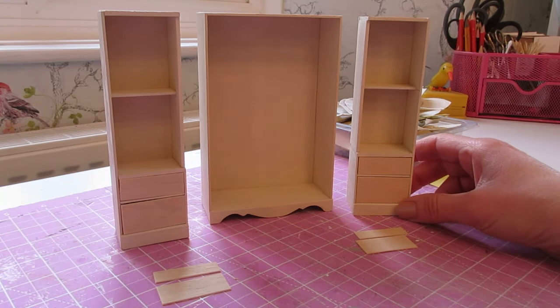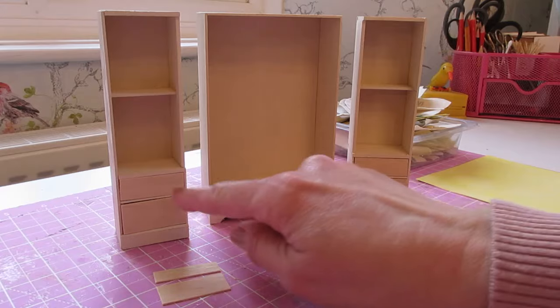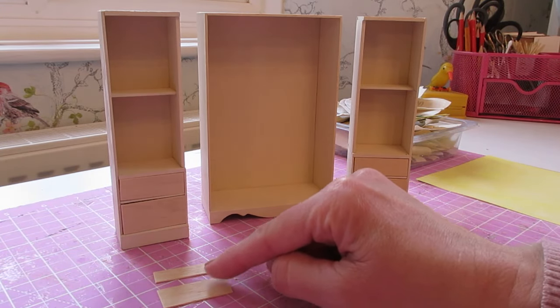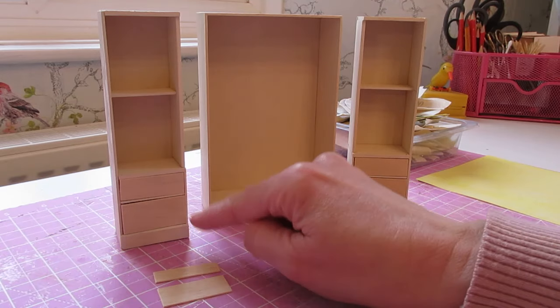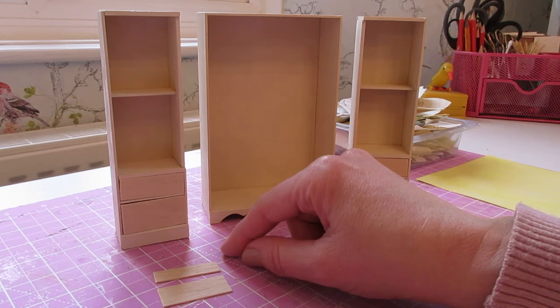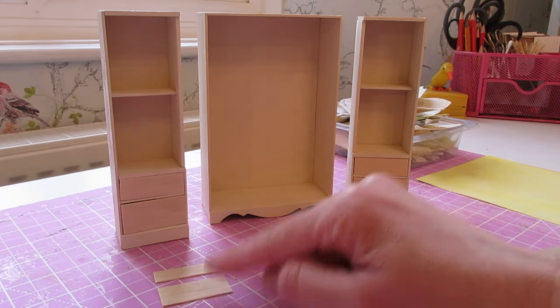If you're a little bit unsure on drawers, do take a look at my YouTube video 'Taking a Good Look Into Drawers' where I give you lots of tips and tricks on getting the perfect fitting drawer. Once your drawers fit nicely, re-measure and cut your pieces for your molding. I take off 3 millimeters — or 1/8 of an inch — from the width and the height, giving you that 1.5 millimeter, 1/16 of an inch, border all the way around the edge of the molding.